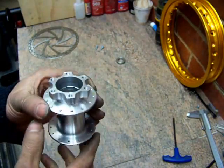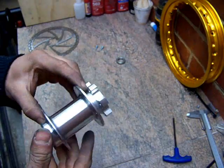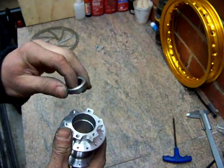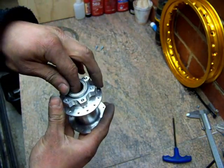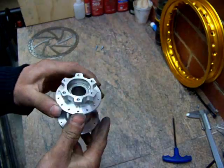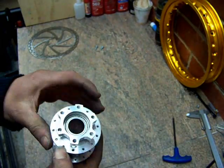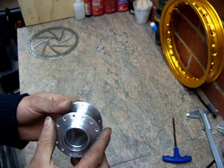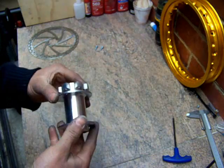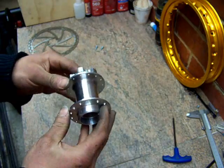Well, this is my hub all done — turned out a bit better than I expected. It's just under 140 grams. I've made it to suit a slimline 20mm bearing. It's pretty snug and thick. I still need to put together an axle. I've got some chrome bar which I need to drill out, probably to 1mm wall thickness, so it should end up being pretty light. There's a bit of a defect there. I went for a rough machine finish because it's a pretty rough-looking machine overall that it's going into.